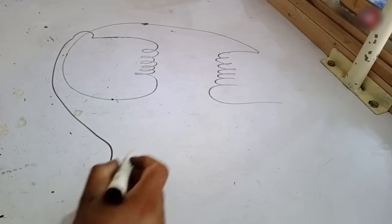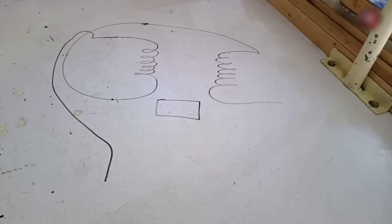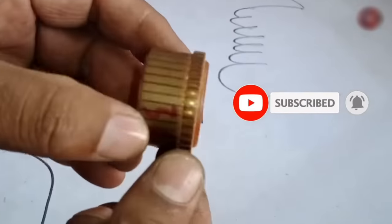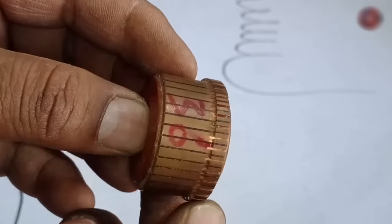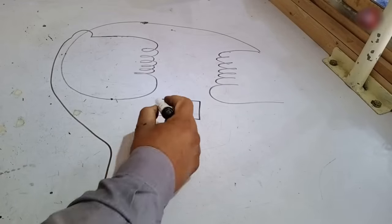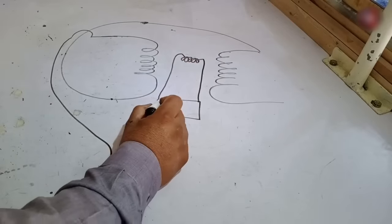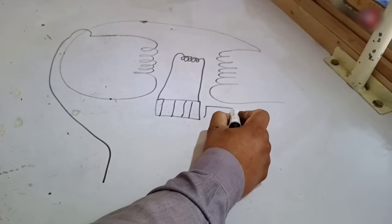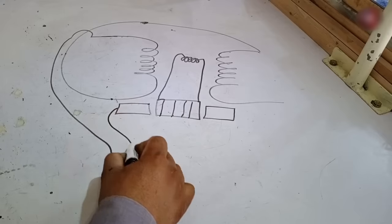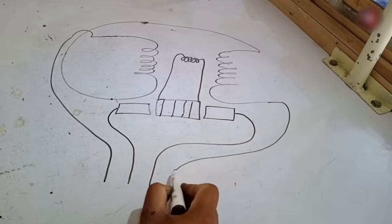Now I will draw the armature of the motor. The armature has a commutator installed on it. This is the commutator — it has 36 slots. It is attached to the back side of the armature where the brushes run. The commutator also has coils inside it which go into the armature. There are carbon brushes on the sides of the commutator. One wire comes out from the left carbon brush, the second wire from the right carbon brush, and the third wire is taken from the stator coil.